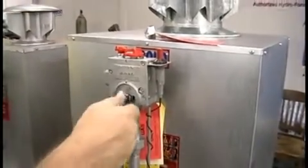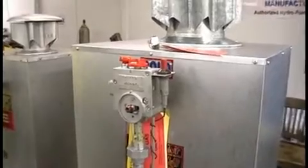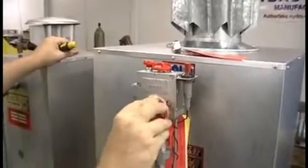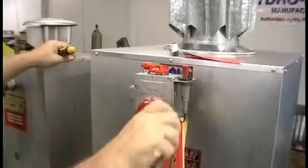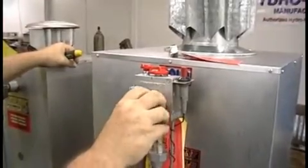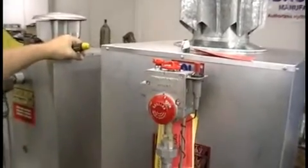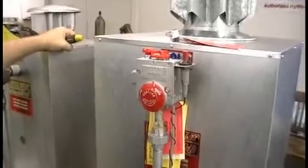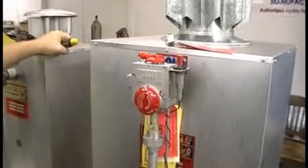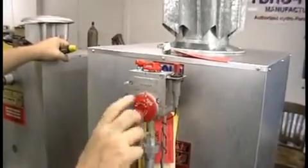And don't ever set this any higher, because remember I had mentioned to you earlier that this really is not the heat control. You've got to look at this control knob as a high limit shutdown, because the only time this dial comes into play is when you let go of the trigger and the water stops. Then finally the temperature will come up to where this is set and shut off. So you get what we call spiking. So let's say it's 200 degrees when you're normally cleaning carpets, and that's what it maintains. But then I turn this up to there, I let go of the trigger, and it'll spike to 250. But then once you pull the trigger and you're doing commercial work, it'll automatically come back to the original 200, no matter what you've got this set.